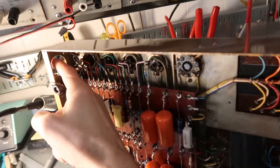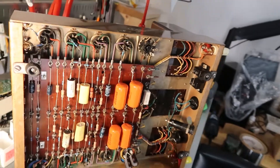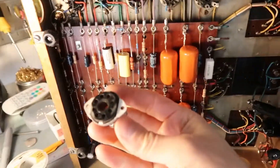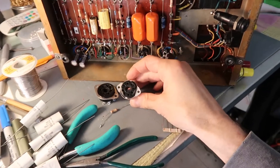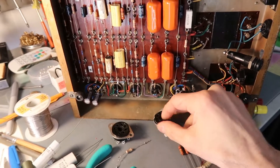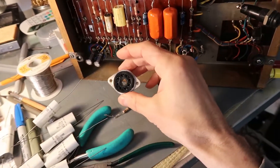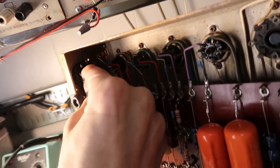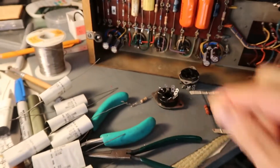This amp is missing its octal connector on the front for providing power to the preamp. I have the preamp but I can't power it because I don't have that octal socket. I grabbed a couple of sockets — this one fits in the hole but is a little loose and the hole centers don't line up. However, this other socket matched absolutely perfectly: it slides right in and the screw holes line up, so we'll definitely be using this on the front of the amp.